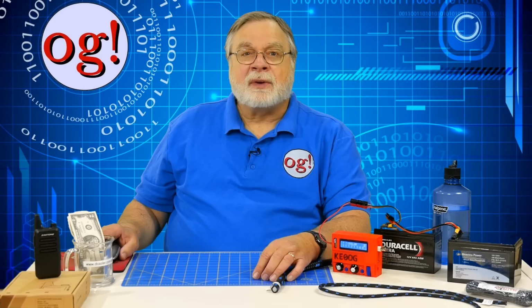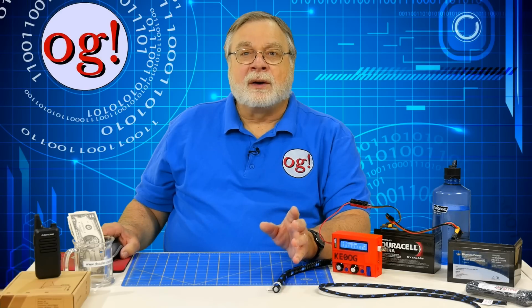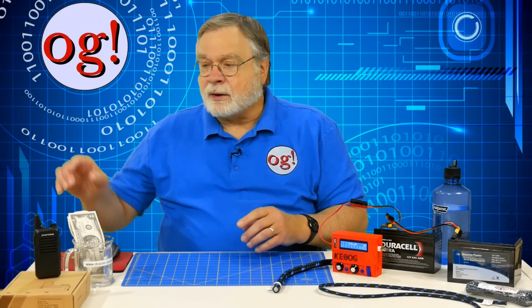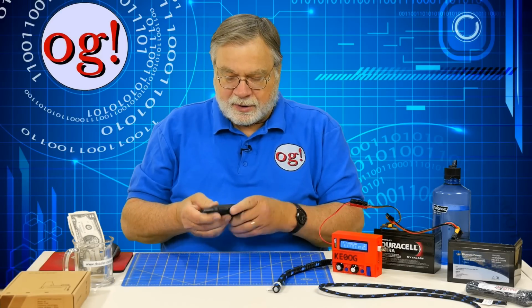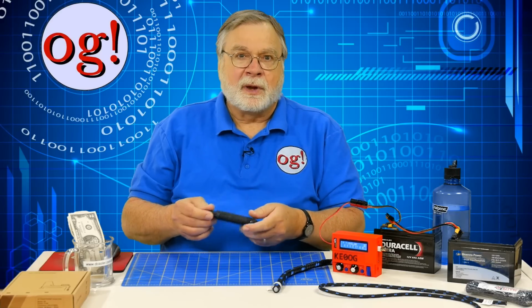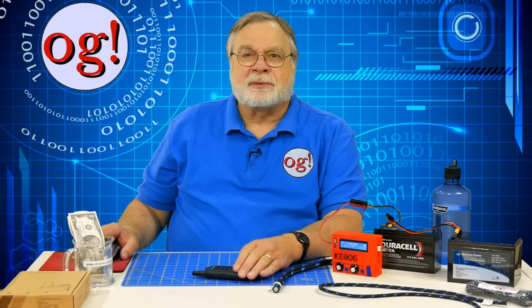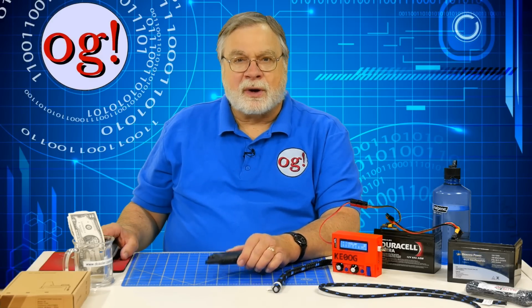They're dinky little FM handheld radios with minimal controls. There's only volume, channel up-down for just 16 channels, and push to talk. I might point out that on one of the 2 radios sent for test, the up channel button makes only intermittent contact. The radios have no provisions for programming from the non-existent front panel. In fact, channel changes are announced by voice.